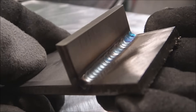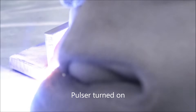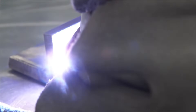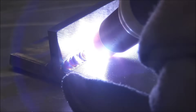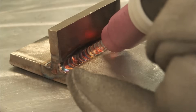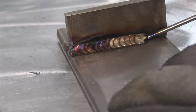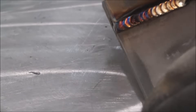That's stainless steel — welds that great too. And then to try to keep it cooler, I was just laying the rod in there and I had the pulser turned on on the machine, so you're just doing spots, not running a hot puddle the whole time, to get that nice pretty gold color.